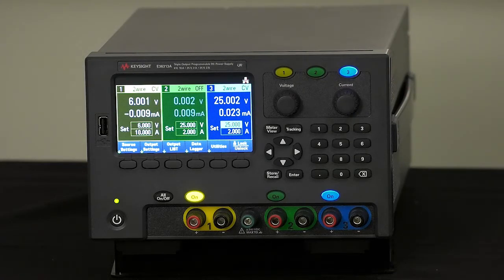We also have the ability to have list sequences, which are the ability to have voltage and current and time pairs to create step sequences through different tests. And this is useful for complex burn-in setups and several other requirements. So the display really gives us that ability to show all these kind of capabilities in this type of product. When before we just couldn't do it. You'd have to have a computer program, or you'd have to have some type of a function independent of this, and strong customer feedback was they wanted it built into the product.